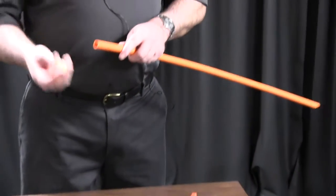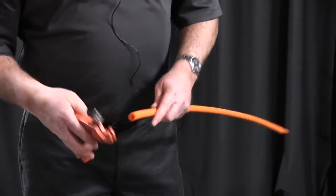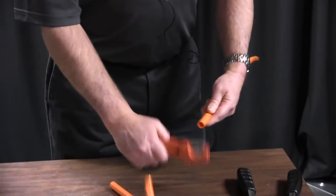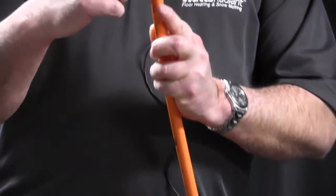When you're cutting the tubing, push down on the tubing cutter and give it a little twist so it cuts easy and smooth. That'll give you a nice straight edge and square — you want it square.